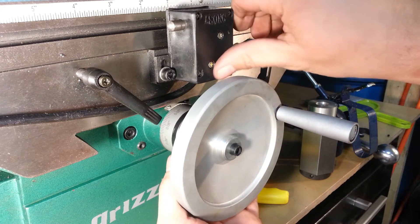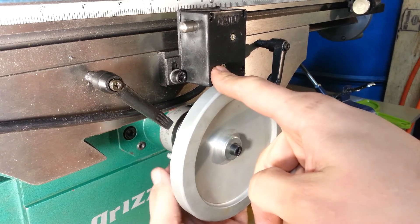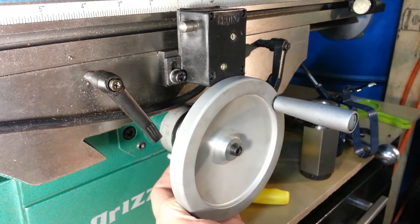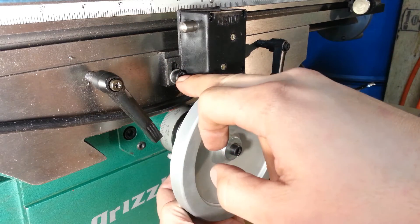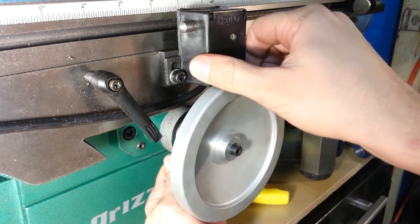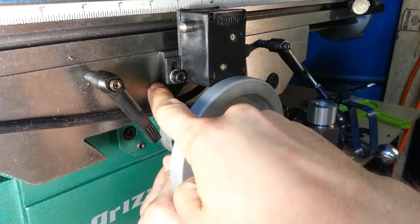You can see there's a little white line at the bottom here because the box hits the hand wheel when it gets to a certain point. It stops against the hand wheel even though there's probably a good inch and a half to two inches more of travel on the y-axis. The cutter is not even to the rearmost t-slot in the table. This is an adjustable bracket, but right now it's at maximum height, so it'll only go down further, which is a problem.